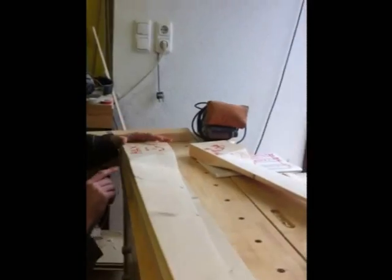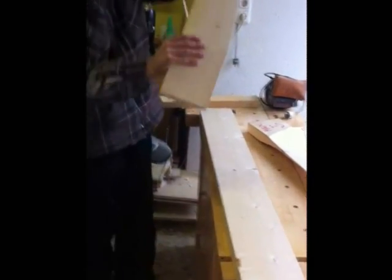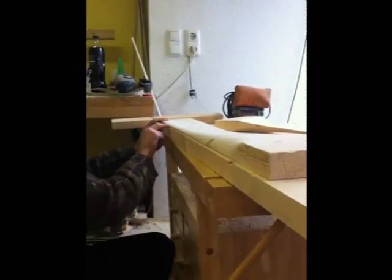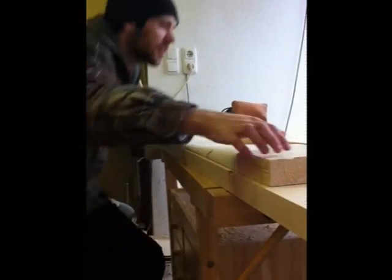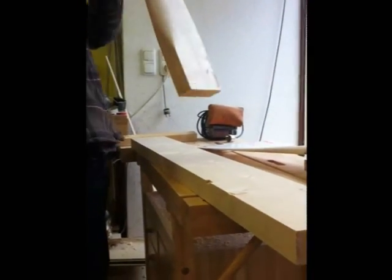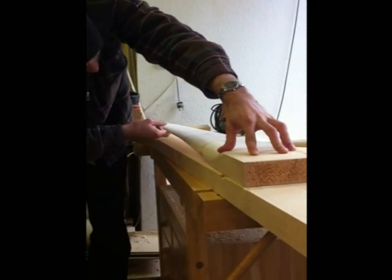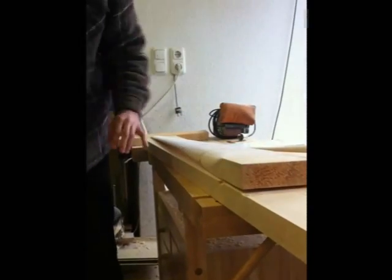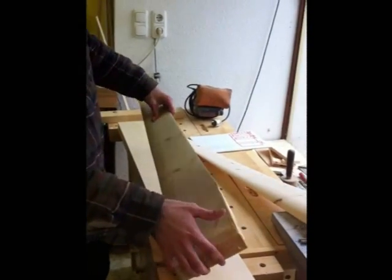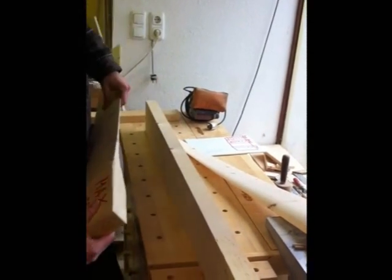Now, in Hugh Piggott's blade, on the windward side, we have an even line on the leading edge, a straight line, and this part on my blade, see that? We take off the material. As I said, we move everything to this side, which spares us from doing any cut on this side. Later on, all we need to do is shape the leading and trailing edge.